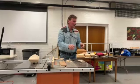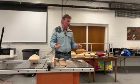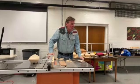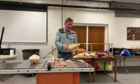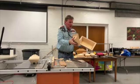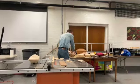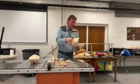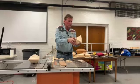And like I say, once I set my width that way, for the length, I just do the 1.61 to get a pleasing rectangle. And the tops just rest. That's it. Just gravity, because there's an angle. They don't want to come apart because they're angled in. And that changes depending on how upright you make them. This one is installed at almost a 90 degree angle as it would be on the ceiling, which means there's almost no angle on this one.